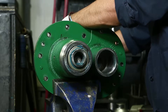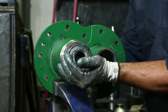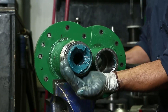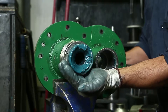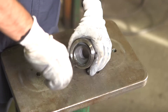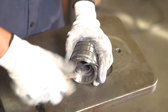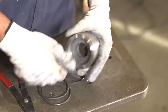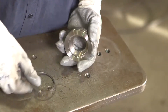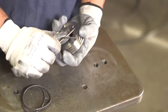Turning your attention to the main drive bearing chamber, use a rubber mallet and Bowie bearing remover — tap the tool to dislodge and remove the lock bearing. Then take a Bowie seal remover and a rubber mallet and gently tap to dislodge the remaining internal components from the inside of the plate. Remove the snap rings from both ends of the drive seal housing, then remove the outer Viton O-rings and internal Teflon seals. Finally, remove any components of the silicon carbide mechanical seal from the housing, if remaining, as well as the outer Viton O-rings.